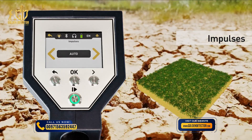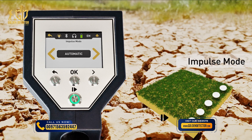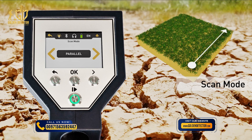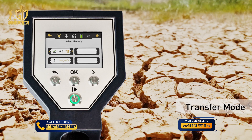Set the number of impulses — these are the scan values that will be recorded line by line. We recommend selecting auto. In this mode, the number of impulses of one scan line will be defined in the first scan line. The impulse mode defines how the single impulses are released by the metal detector; here we have used automatic, where each measure value is recorded automatically and continuously without any breaks. The scan mode defines the direction on the scan field; we recommend the easier mode parallel, which scans all scan lines in the same direction. Finally, define the type of data transfer: choose memory and select a slot to store the measured data in the internal memory of the Rover C4.